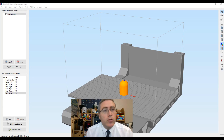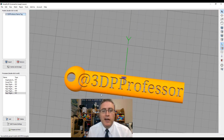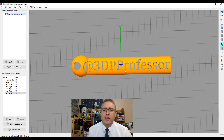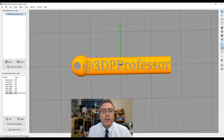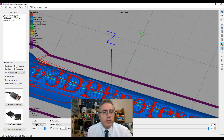Now let's talk about another setting: thin walls. Let me remove this model and drop in a name tag. I intentionally use this when teaching 3D printing to kids — invariably they ask about making their name a hole, and when they print it the letters like 'D' and the hole in 'P' fall out. Being a rounded model, let's slice it with normal settings and turn off travel moves.